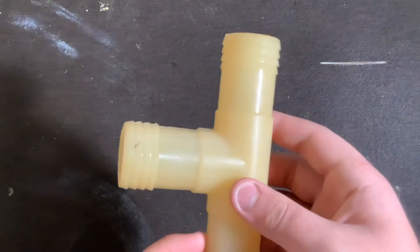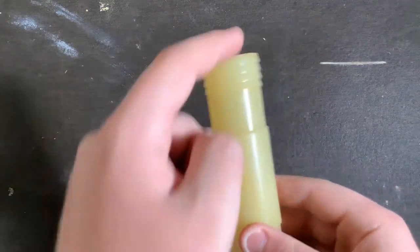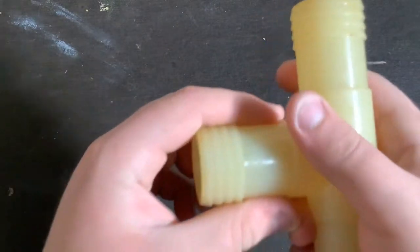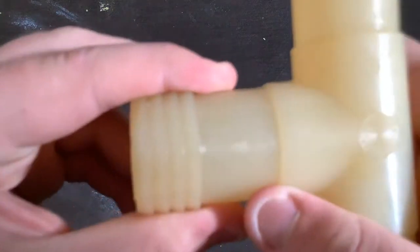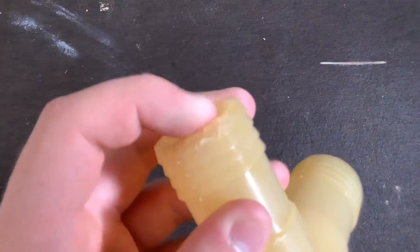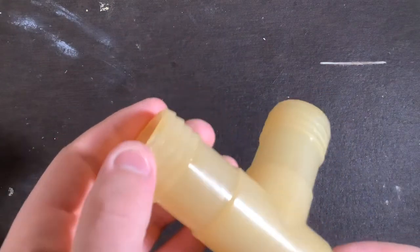It's inch and a quarter on each end, so any one of these could be where the water is coming from. Usually this would be the main with one coming off of it, or this could be the main with two coming off of it. You can see the way these barbs are designed — you can easily put a pipe on but can't easily pull it off because the barbs are flat on the other end. This barb is cracked, and my guess is that this fitting cooled too quickly, making a crack when it came out of the mold.